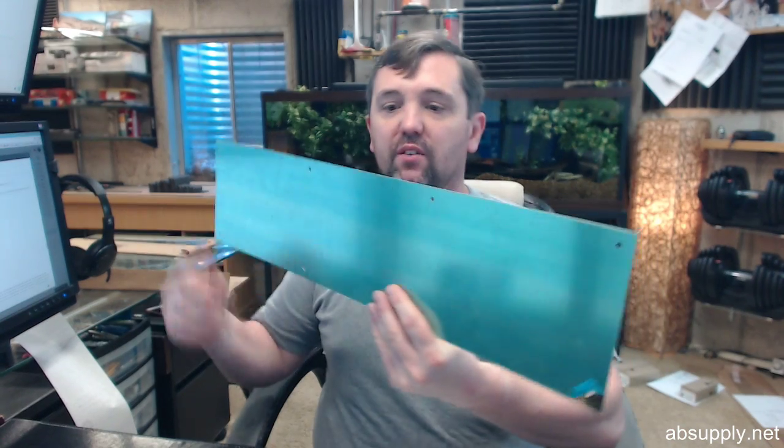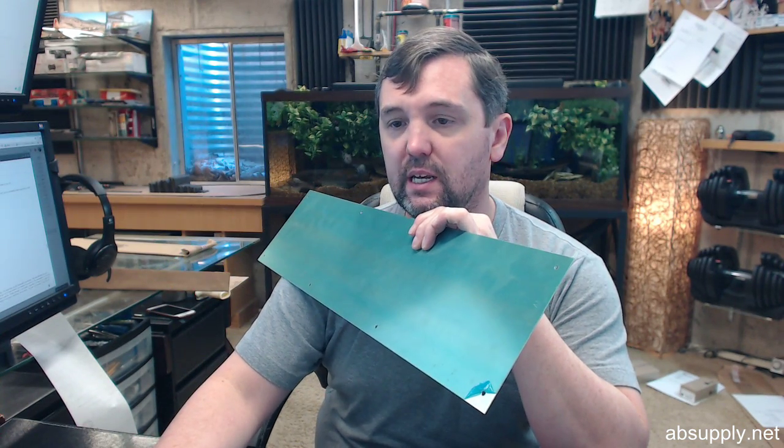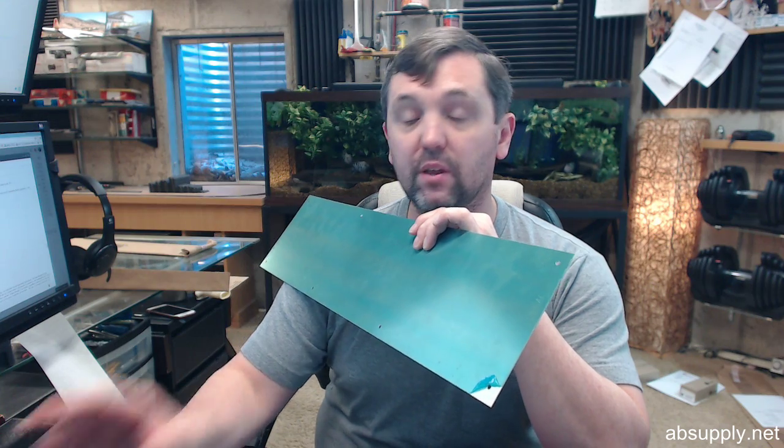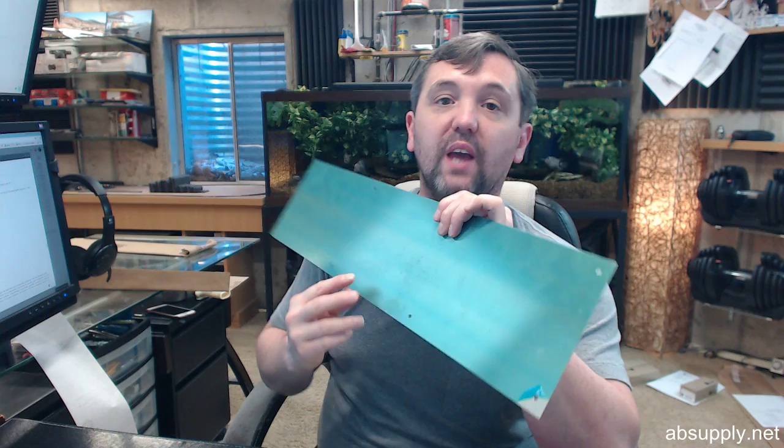In this video is to bring you a closer look at the Hager number 199B kick plate. So 199B from Hager is going to be representative of a plate that is going to be a few things to define it. First of all, the 199B is going to be 38 thousandths of an inch thick, 0.038.